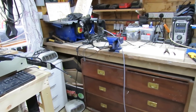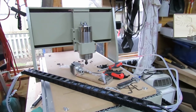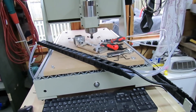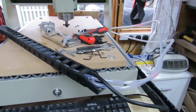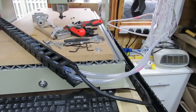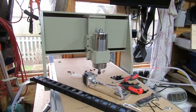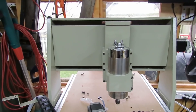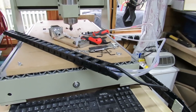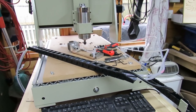I'm having an absolute disastrous week — as you can see the CNC machine's all in bits. I've had a broken cable on it; I've got to replace one of the cables which goes through all this cable carrier work and up to the top. It's the one with the stepper motor right on the top — not the easy one. The cable's all got to be fed back through and resoldered; I've got some new cable going on it. I'm just wondering whether to do all three stepper motors at the minute or just the one, but this is the second thing gone wrong this week.